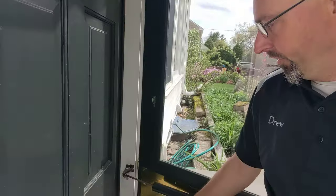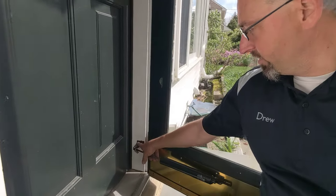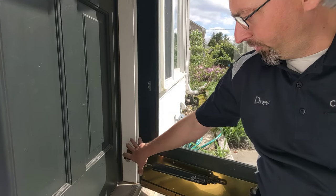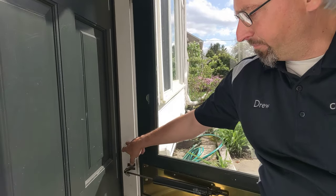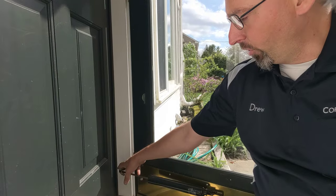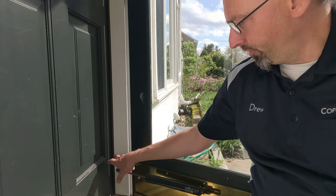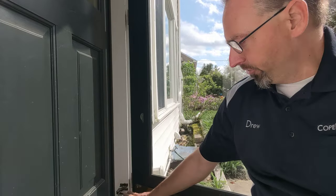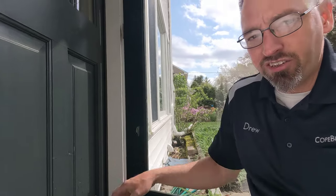What are some of the other things we run into with storm doors? If the door gets ripped really hard, we've seen these hinge pieces pull out. It is possible to take an oscillating tool, cut the damaged section off, put a new piece of wood in there, use wood putty, paint it, and then get some really long three-, four-, or five-inch screws to try to get back into the stud — assuming you don't have an alarm system or doorbell on that side complicating things.